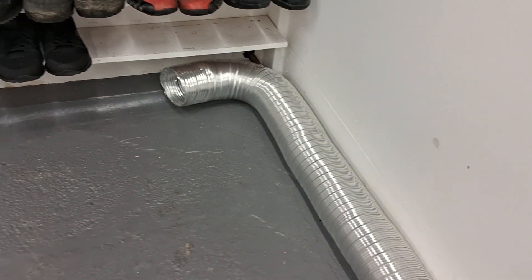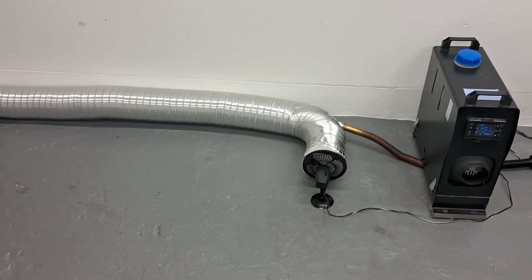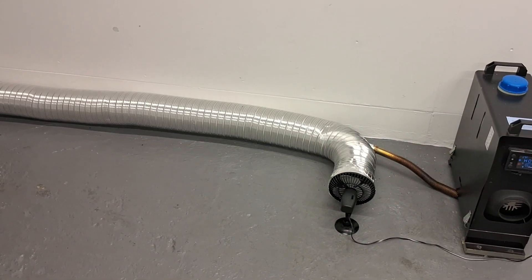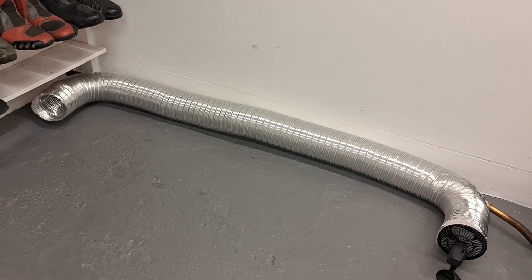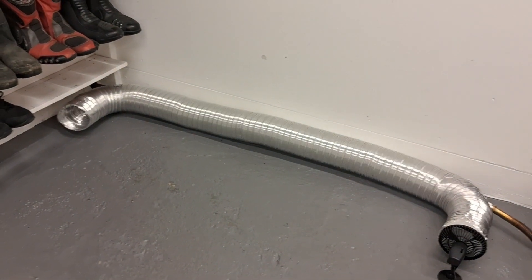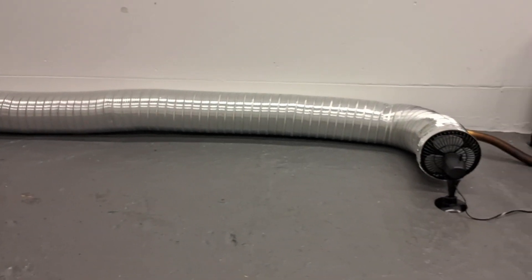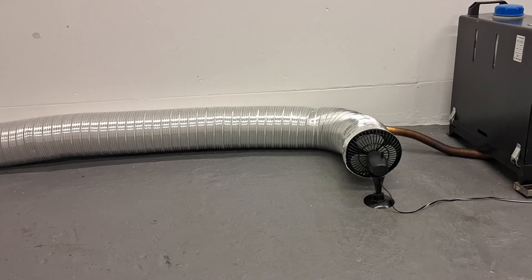It's blowing a nice warm air at the other end. I'm just showing you the concept of how we could use the heat from the exhaust pipe via some ducting by heating the air around it. This ducting could be routed into the room next door, which could be another workshop, garage, shed, or utility room. By experimenting with different size tubing and probably different size fans, or certainly variable speed fans, there's something in this we could go somewhere with.